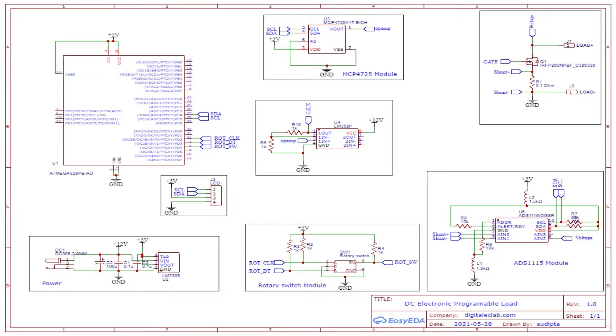In the updated circuit diagram I have used the MCP4725 DAC module to convert the digital signal to analog. The analog output is fed to an op-amp which doubles the voltage so I can drive the gate voltage up to 10 volts. This is a fairly simple circuit. The rectangular blocks represent module circuits, so if you have the modules you just connect to the respective pins without needing to build the detailed circuit.